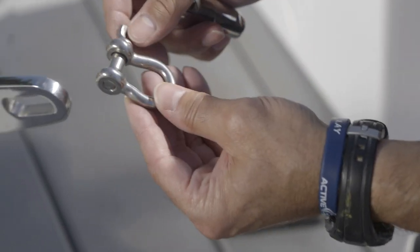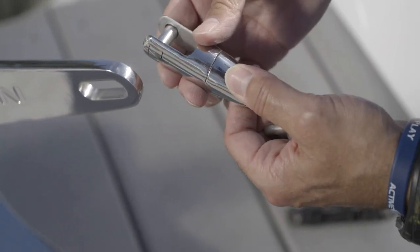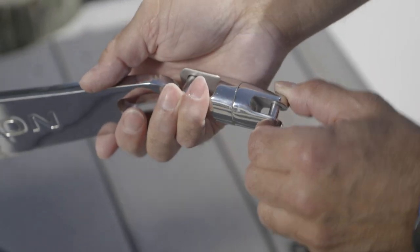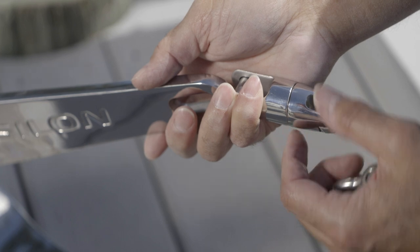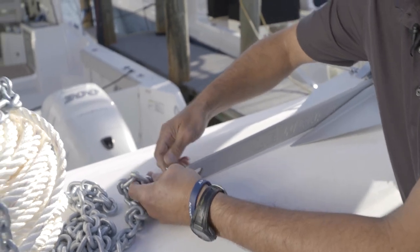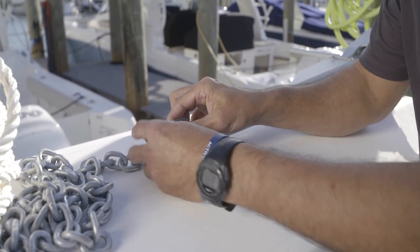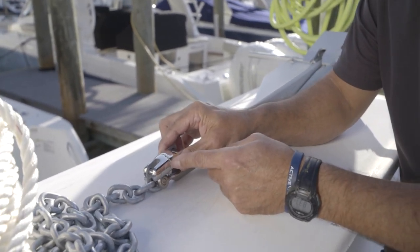The advantage of a shackle is going to be the strength — it's going to be a little bit less prone to shearing issues than the swivel. The swivel has an issue: if you have it stuck in rocks and you're trying to release your anchor and you pull from the side, this is a weak link, and we're always looking for the weak links in the whole anchoring system. So the shackle, which I prefer to use in this situation, is a stronger connection. You don't want this thing to get cocked and create a stress point on a shear point.